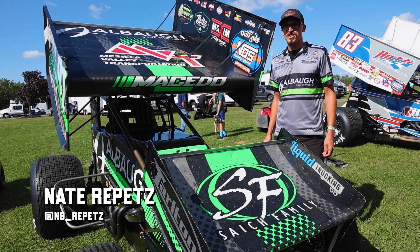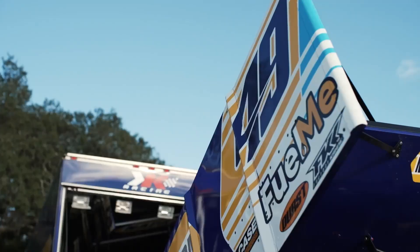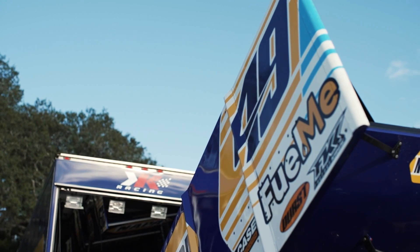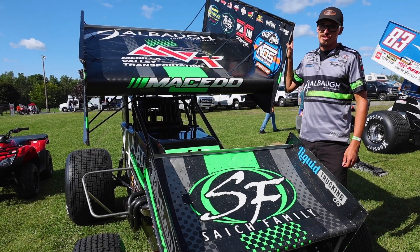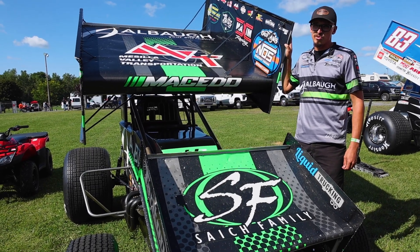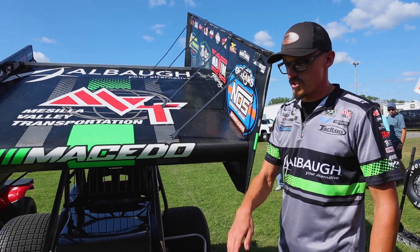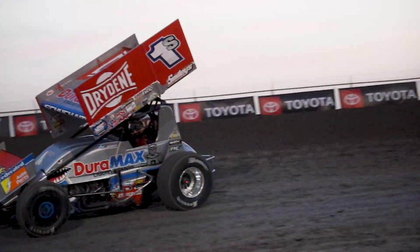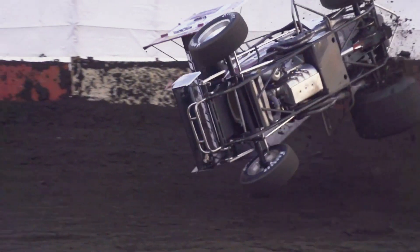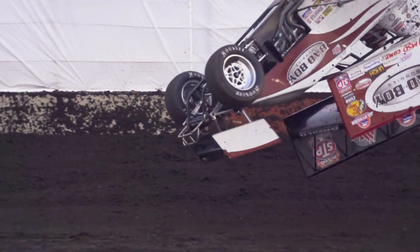First, some characteristics of both the nose wing and the top wing. They're constructed out of aluminum and we get them at our shop as separate bellies and sideboards that we attach together using silicone and eighth-inch rivets after they are powder coated. The wings provide downforce — as air flows over the top, they push the car down into the racetrack. They're also a safety feature; they'll absorb impact and slow the rotation of the car in case of a crash.